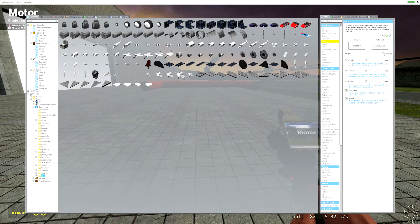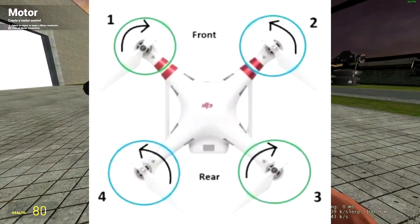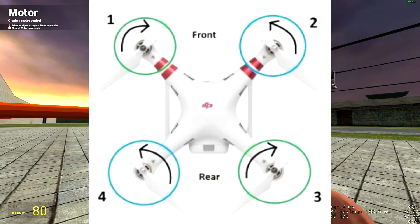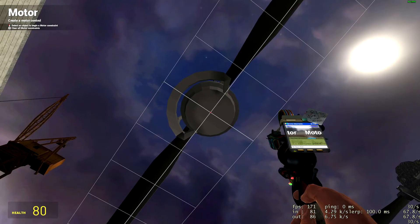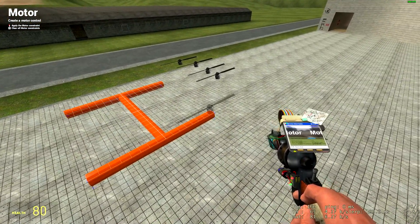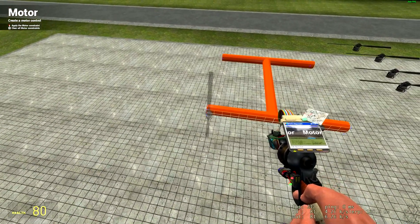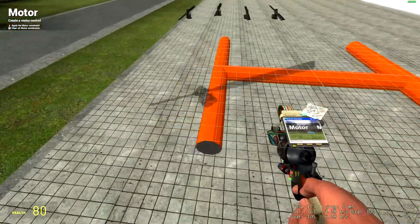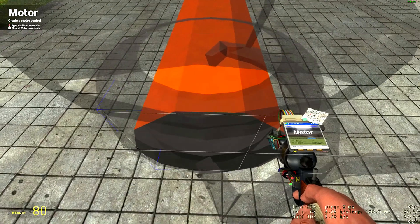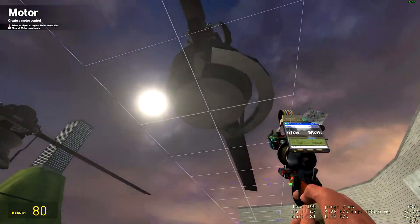Set the speed as high as it can go — that's 10,000. You can type in more to make it go faster if you want. You basically just want this to spin as fast as you can get it to spin. There's a special order for drone propellers: opposing corners should match in rotation. Front left and rear right are clockwise; front right and rear left are counterclockwise. So these are going to be our clockwise propellers, and we're going to try to put them as close to the center as we can.